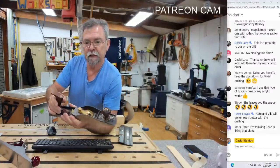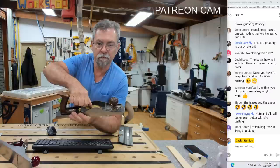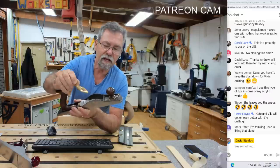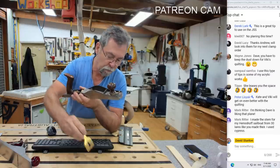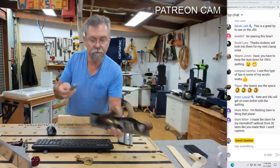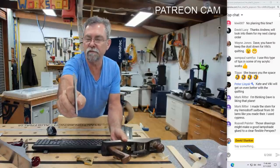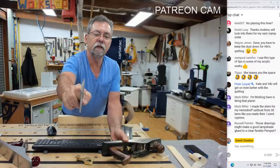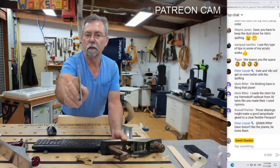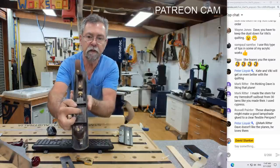With these things, I do like the plane mark. This little clamp here locks everything in place. This is basically the lever cap, but instead of a lever, it's got a brass thread and screw. These blades have no backing iron because look at the thickness of that. That is a good 4.5 millimeters thick. So I'm guessing in the Imperial, that's around 3/16 of an inch thick, maybe just a touch more. But this is a lovely blade. And then you've got the retaining screw here.